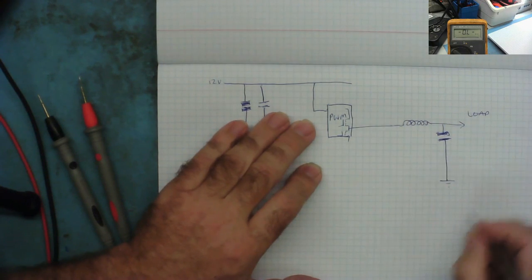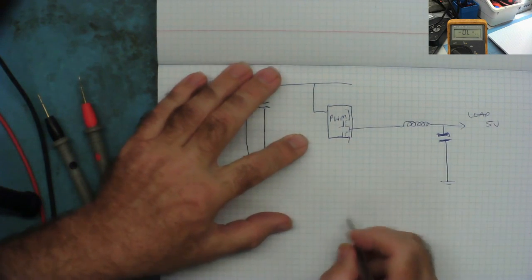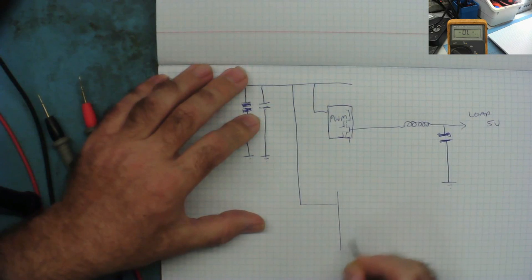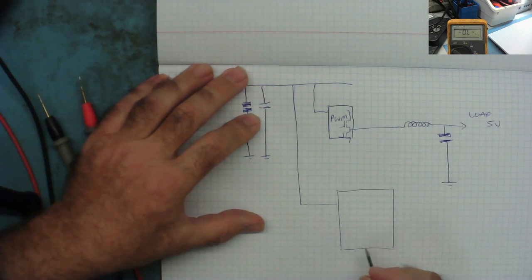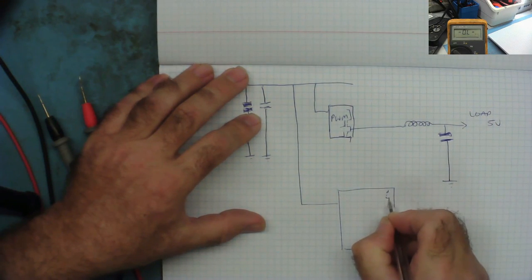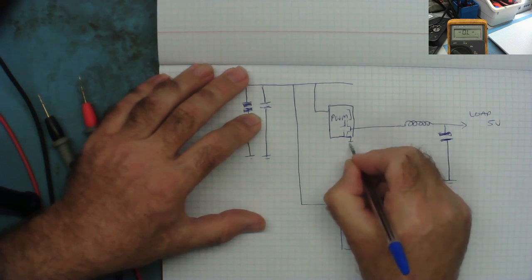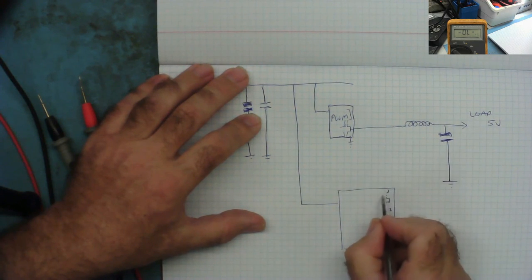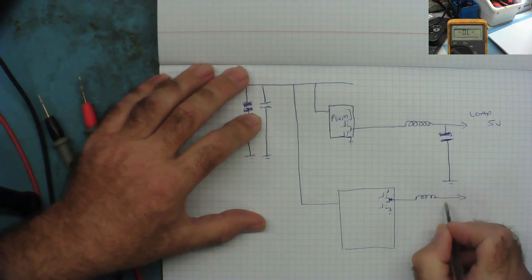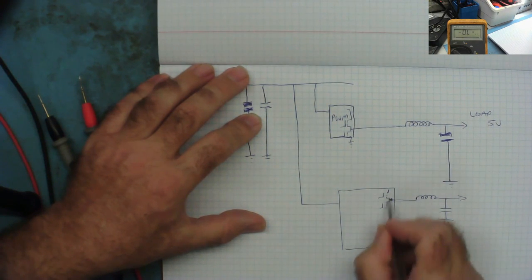And they marked on the board, this one was 5 volts. And then we have, I think it was 3.3, 1.0, 1.5, whatever it was. So we have that there, yeah? And we also have coming from here, going to another chip. This is the one that controls three coils, yeah? And internally, again, there'll be three sets of these MOSFETs. If I've got space to draw them again. This end goes to ground. This end goes to 12 volts, yeah? Again, controller drives it. We have a coil. Output. Capacitor. Right. And we have three of these inside this chip, so I won't bother drawing the MOSFETs again.